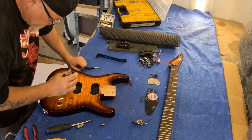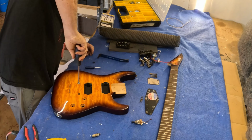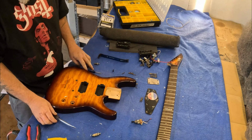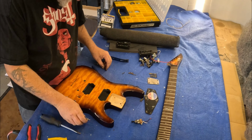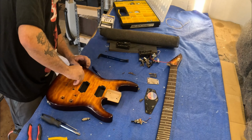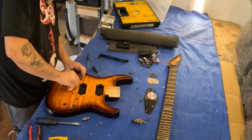And then I took the post that belongs to that sleeve and used that as the nut in question. What I'm actually doing is pushing on those other screws as a spacer, and it pulls the sleeve out ever so much. Then I have to add another small little screw, basically grow the spacer, and keep working at it. That's what I had to do on the fly, only because I didn't have a bolt with the correct type of threads to do it. A little bit of a hassle, but yeah, got it out. Sometimes you gotta think on the fly.